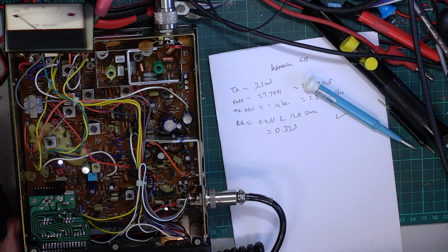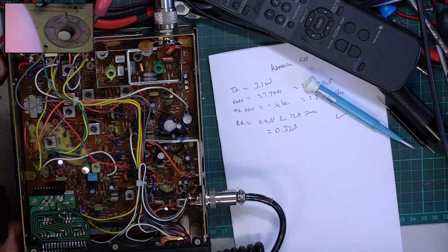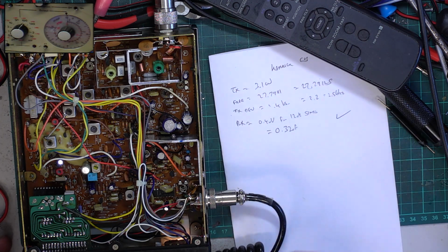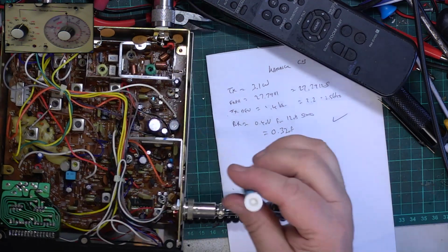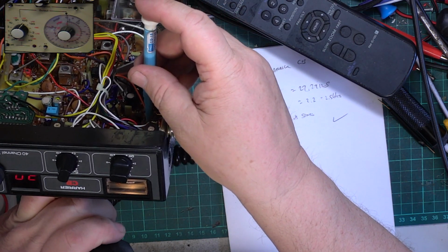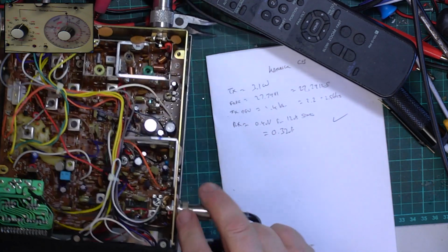So we'll put the signal generator now to 100 microvolts. I'll show the attenuator controls. Big one's on 100, that's on 10. What we're going to do is check the squelch out. Oh no, we're not. We're going to do the signal meter. So it should read exactly S9, and it reads 8. So with the signal meter preset, we can adjust that. So 100 microvolts is S9 on a CB in the UK.